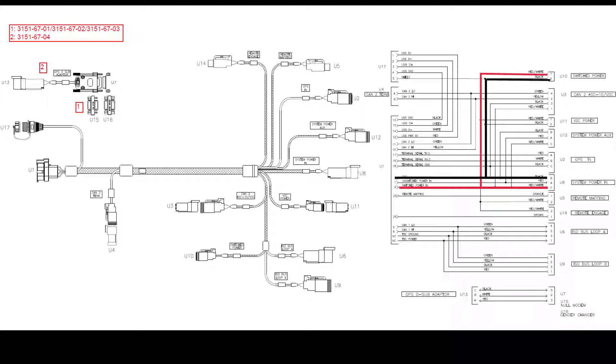When the key is switched on, power will be sent to the monitor. Power is connected through the tractor via the U8 plug, and switched power is going to be pins B and C on the U8 plug. When the key is turned on, it sends switched power and ground to the monitor — U1 is the monitor plug. It also splits off and sends power up to the switched power plug, U10, to turn the rest of the system on.